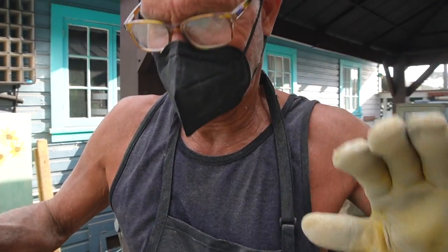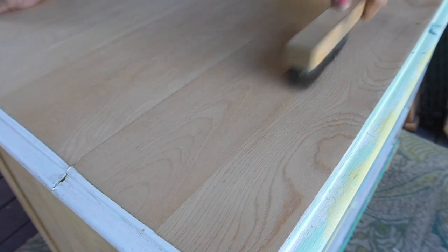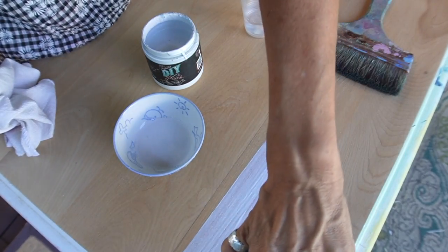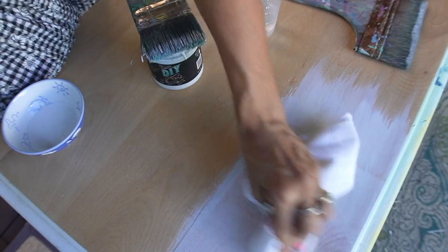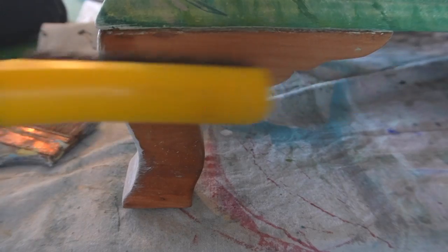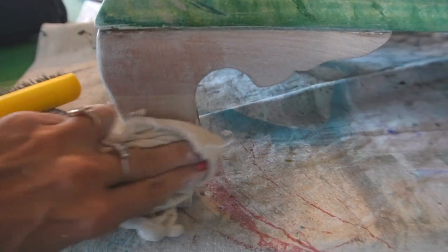Bobby volunteered to sand down the rest of the dresser so I could create a special finish. It had caked-on latex and he spent two days sanding it down. What I'm doing here is called a ceruse finish - basically you take a wire brush, open up the wood grain, then put watered-down white paint, wipe it back, and show off the wood grain. I saw this technique on Kristana's channel - she goes into way more detail, so I'll put a link to her video below. Because DIY paint is so easily reactivated with water, this was a pretty simple process and it made the rest of the dresser have a driftwood effect.